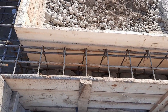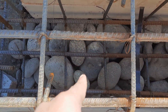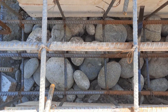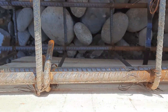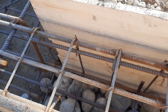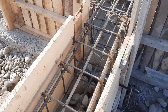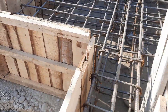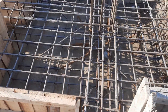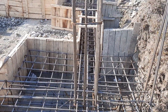It is also aided by individual footings. You can see there are three steel rods at the bottom with 16mm diameter and three steel rods at the top portion also with 16mm diameter. 60-grade steel rod is used here. The spacing is about four inches near the support, and after a distance of L/4 it becomes about six inches.